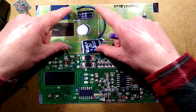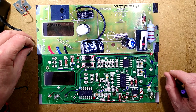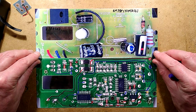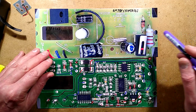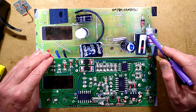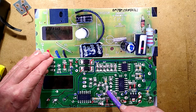Here is the circuitry — the top of the circuit board. It's a single-sided board but there are seven links on this side, notably this insulated black one that takes quite a convoluted path across the board. It's based on a microcontroller — a generic one-time programmable device. It's quite cheap; it's got the fanciful name EM78P173N7014J. It's got a crystal and a couple of decoupling capacitors going to ground as load capacitors for that crystal as a time reference.